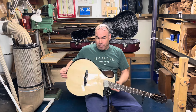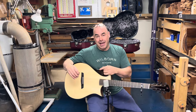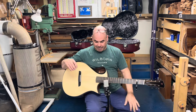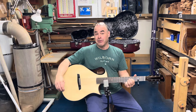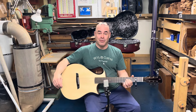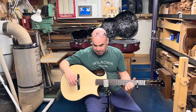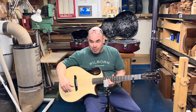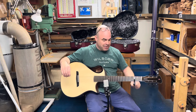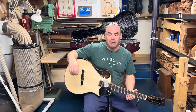It's also very, very stiff wood. So I was able to thin the top quite a bit, and when you thin it, it weighs less. If you can keep the same stiffness with less weight, that's what you're looking for. That means less string energy has to be expended on just exciting the top, and more energy can be expended on maintaining the tone — a long sustain and more sophisticated overtones. It makes it much livelier. It's not some big leaden slab you have to really reef on to get going. The sound just immediately emerges when you play. That responsiveness is really gratifying as a player.